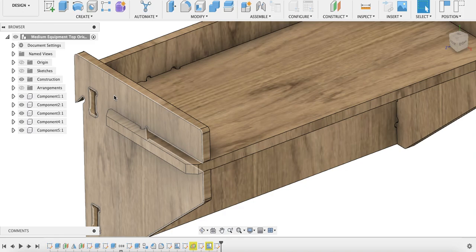So the way you're going to go around that is, if you're getting 0.02 inch too small on your hole, you'll want to select a file from my zip folder that is 0.02 inch thicker than your measured material thickness. So let me explain that.